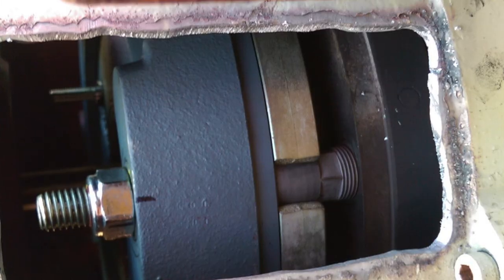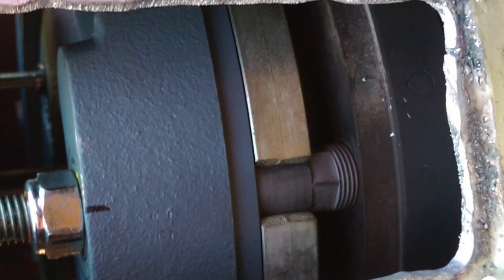Some ride manufacturers use a DC motor with a brake. The SLC I worked on had a brake on the back of the lift motor. So it didn't have a Sprag to prevent it from turning backwards, but as soon as the lift motor stopped for any reason, you took power away from it, the brake applied and it locked that motor up. The train couldn't go anywhere. Again, this was independent of all the anti-rollbacks on the train. This was simply the chain itself having its own system of anti-rollback on it.